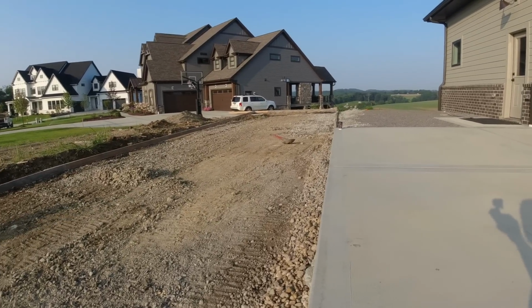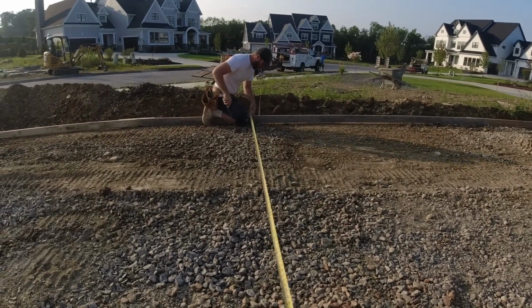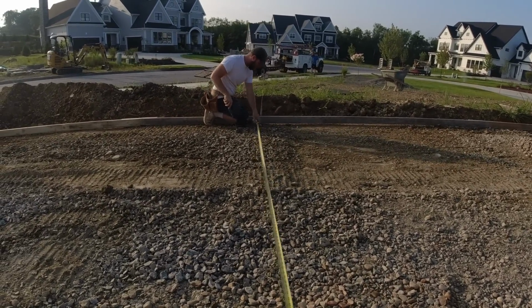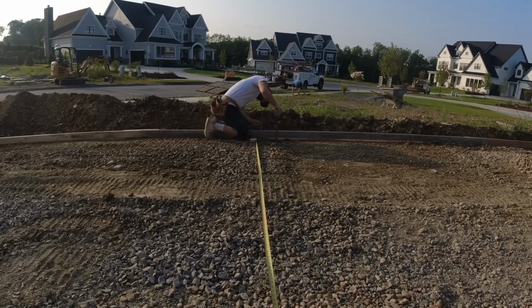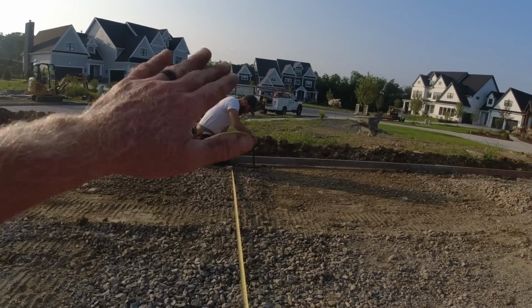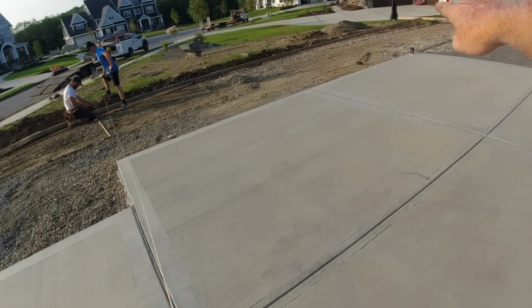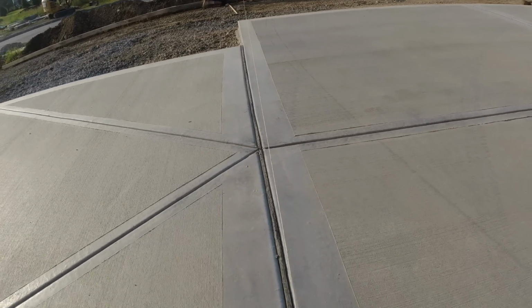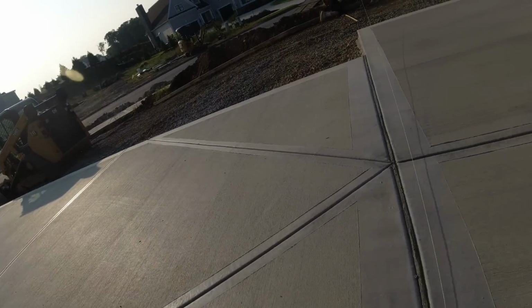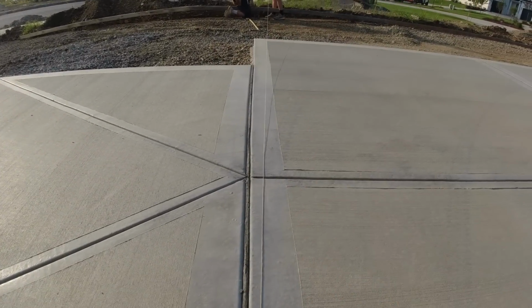We're square with the house. Now we're coming parallel up. Elliot, string right here. Steve will pick that up. Just a little bit of a guess, and he'll always guess high. It's easier to take it down. We know we're falling coming out. We know we're 1% forward. So Elliot's going to go down on the lumber. I'll be on the concrete. We'll follow the same plane out.